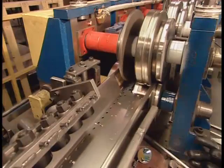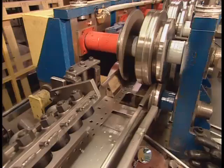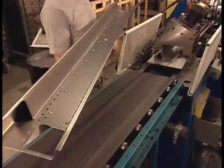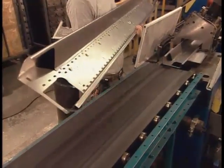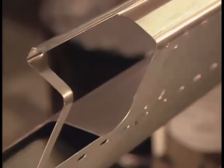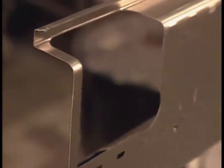After the last fold, a computer-controlled die cuts the casing to the required length. The higher the heater's wattage, the longer the casing has to be. Models range from 300 watts, about half a meter long, to 2500 watts, almost two and a half meters long.